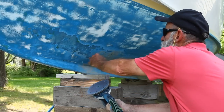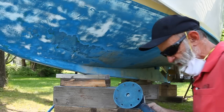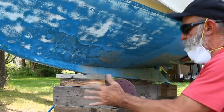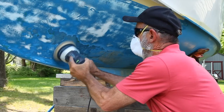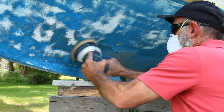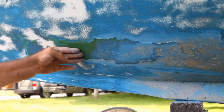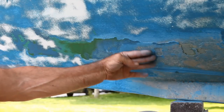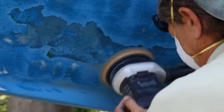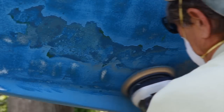We've got some very heavy paint down here that's never been removed. I'm going to remove the 80 grit and stick on a piece of 50 grit and see what that does to this thicker paint. You can see here where I've just gone over it with the 50 grit and it has smoothed that right out, almost taking it off completely. Here it is again — all scaled up, very thick — it's like a green bottom paint that was on here one time before that hasn't been taken off, and this sander seems to take care of it quite nicely.